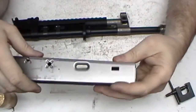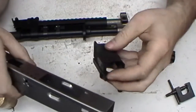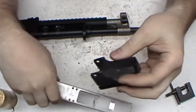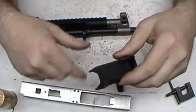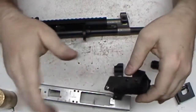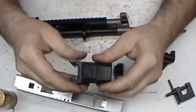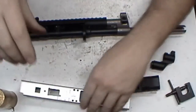So I was kind of wondering how I'm supposed to figure out where to put the hole on this thing, because I don't have a 545 trunnion to copy the dimensions from to know where to put that hole. But luckily, Curtis from AK Builder, they give you some instructions that actually have pictures and show you the lines, which direction, where to put the hole in the trunnion. Then you can use the trunnion as the template to put the hole in this. So that's good.